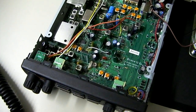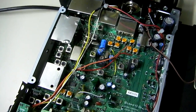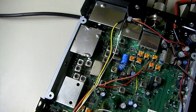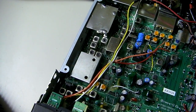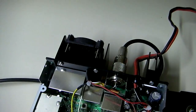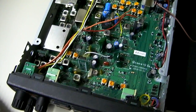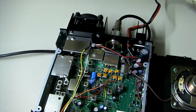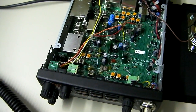This is the inside of the radio. You'll see it looks similar to the Magnum 257 in layout. It's surface mount technology on these boards — that's one of the reasons they're so compact. You'll notice one of the main differences between this and many other radios: there are quite a lot of shielding boxes. This radio is going to have very good single sideband stability, and those boxes help with that — they also help prevent RF from getting into different areas of the radio. Even the finals and fan section are shielded. It's a very nice, clean layout, not a lot of wires running around. Surface mount technology makes this radio very small and compact — that's just the width of my hand. Great for small installs and newer vehicles where you just don't have a lot of room.